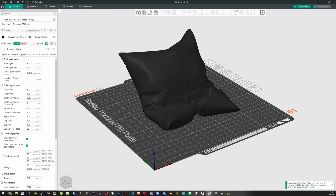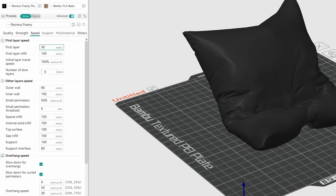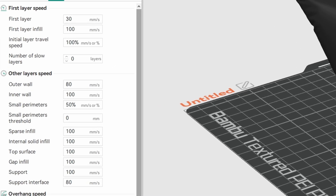For speed, it's much softer than A95, so I initially cut my profile in half - most parts of the print won't be printing more than 100mm/s. After more testing, I was pleasantly surprised to find I could print faster, but it really depends on how much you want it to foam as it's extruded. I also love the sound it makes when you squeeze it.